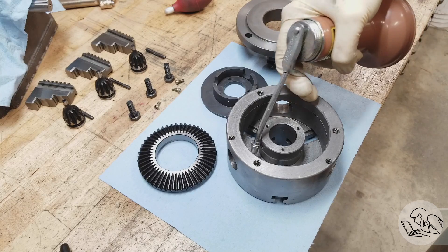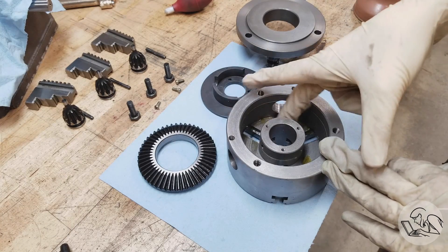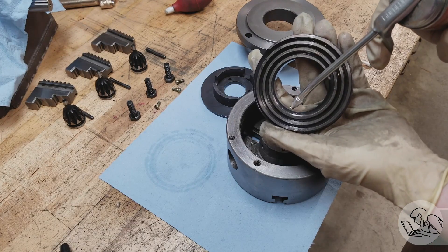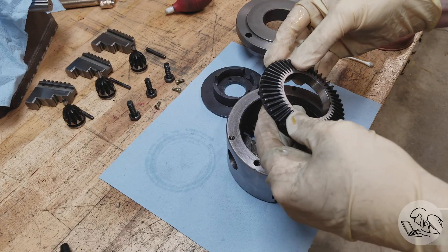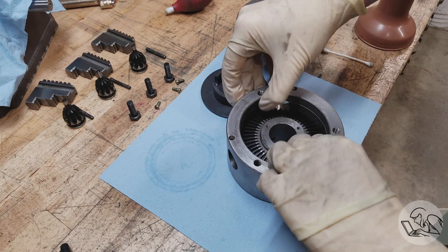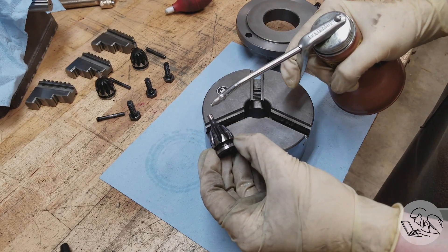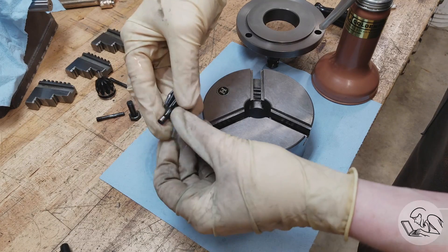On to reassembly now, and I'm going to be oiling all of the mating surfaces. I'm using way oil because it's sticky. There's a lot of debate about what lubricant to use in chucks — some people prefer grease because it stays in place better, but grease also attracts chips and turns them into a grinding paste. I prefer oil on any surfaces that are reasonably easy to get to so that you can reapply as needed. But don't get carried away with the oil — use just a little bit, because if you put on too much you're just going to be wiping it off your face the first time you spin that chuck up. As we say in the car biz, assembly is the reverse of removal. Don't forget to oil the little ground bearing surface on the ends of the pinions — that's very important.